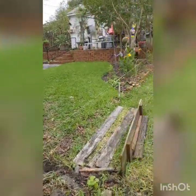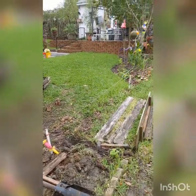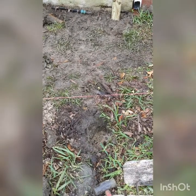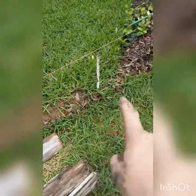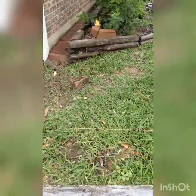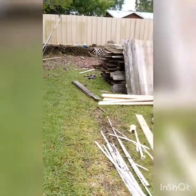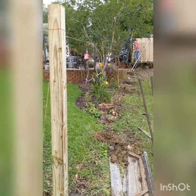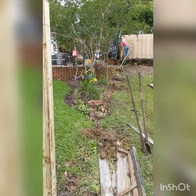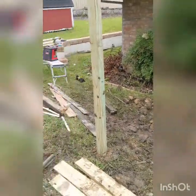I'm also going to put in two five-foot gates, one at this house and one at that house — it'll be a little under five feet. I start with my corner post, dig a hole. My brother went to get a rotary so we can get that concrete out. I'm going to go every seven feet ten inches and dig a hole. I'm going to use 16-foot two-by-fours, stagger the seams, and nail them straight onto the four-by-fours for strength. We're going to string line for the top and the bottom level so when we put the four-by-fours in we just have to level it sideways. It's been a very wet and muggy day, so hopefully we'll just be able to get the posts in and some rails.